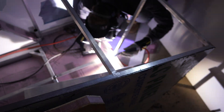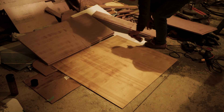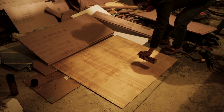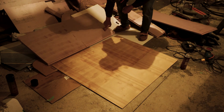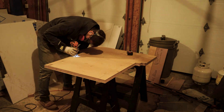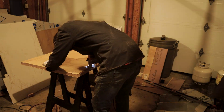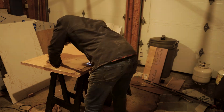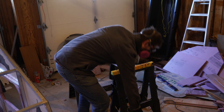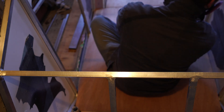The floor will be finished. I decided to assemble the floor in two pieces originally, but later on I actually cut each piece right down the middle so I could get it out of the trailer if I ever needed to. Again using the flush-cut router to cut channels where the floor overlaps the ACM panel on the inside of the wheel wells, just to keep everything nice and level. The floor bed is a little longer than eight feet, so I've got one little piece to finish it off. Finally got the floor done.